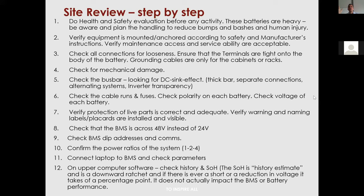The first main point is always health and safety. A lot of times I've seen batteries pushed up against the wall or placed on the floor — because they come in nice steel boxes, homeowners don't realize the risks. Make sure batteries and equipment are not in the way of falling on people, giving electric shocks, or allowing steel pieces to join DC paths and short out equipment.